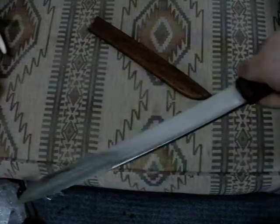I've made this handle with wider stock so it's got a pommel and guard, and this blade's been adjusted with a hollow ground swedge to distal taper the blade, reduce the weight, and make this a lighter, faster, more sword-like in properties than a machete. It's very light and graceful in the hand.